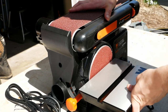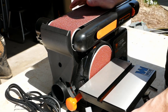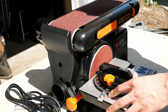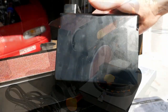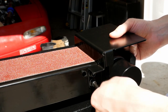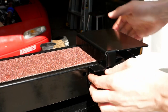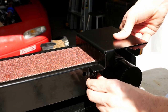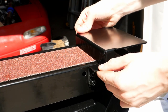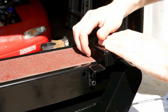I didn't expect it to be quite that sturdy looking at the design, but so far I'm impressed with that. Next thing we could do is go ahead and get our little miter gauge in here — this just slides into place, right there like that, and this allows you to get different angles on that disc. Next up, they give you this little material stop here. And they do supply you with an allen wrench to tighten this down just in case you don't have one. Now that guard is all installed on there, you do want to tighten it and make sure it can't move. You want to make sure that your belt isn't going to contact that guard.